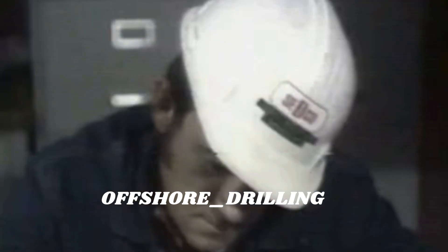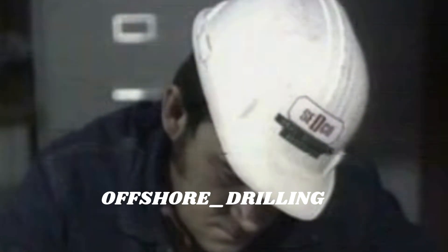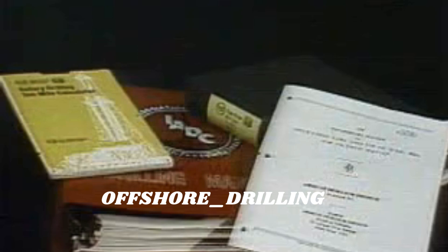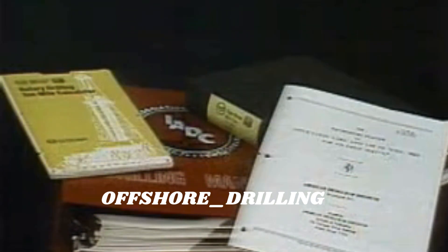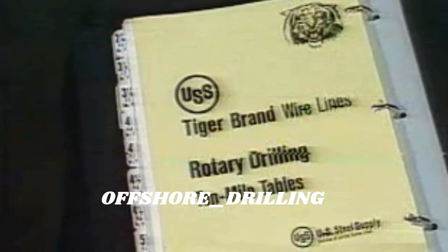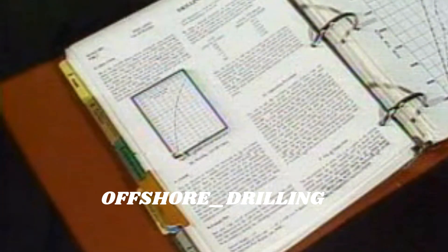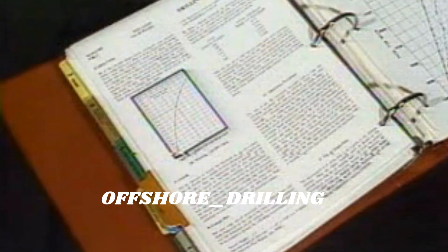Try to get into a routine. Adjust your cutoff program only if the need for a change is consistently evident. All the charts and tables you need can be found in one of several sources — this slide rule has just about everything, as do most wire rope suppliers' ton-mile tables. The IADC drilling manual has this information in its section on wire lines, and API Bulletin RP9B is one of the most complete sources available.